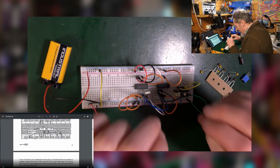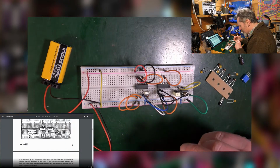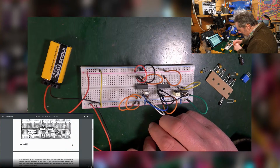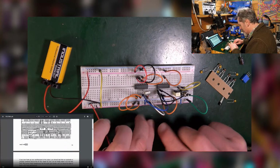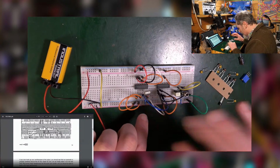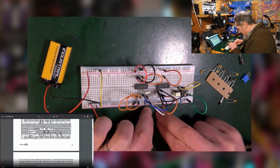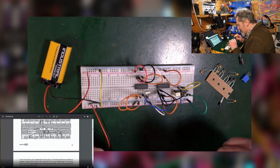the op-amp is creating a buffer which, without interfering with the circuit, is measuring that voltage change in an isolated way. So it's buffering that oscillation without affecting it. Unlike if I'd plugged the audio thing straight in, then the signal would have gone straight through it and wouldn't have been filling the capacitor, because it's easier to go this way. Whereas the op-amp buffer is measuring that oscillation without interfering with it.